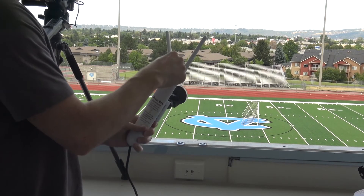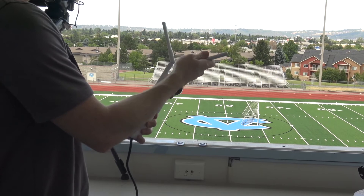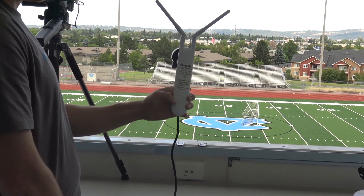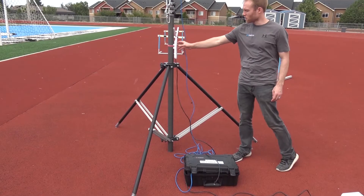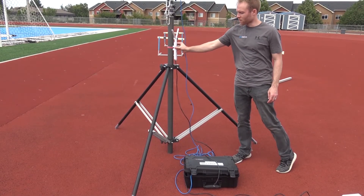The second antenna with ears creates a bubble of Wi-Fi which still allows you to connect from about a hundred feet away, again assuming no obvious obstructions. If you have the antenna with ears, screw the ears into the antenna and position them at a 45-degree angle. For either antenna use the velcro strap to attach the antenna to the tower pole.